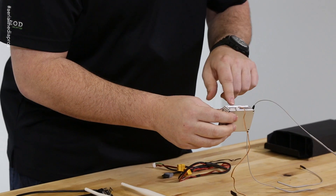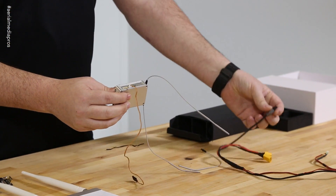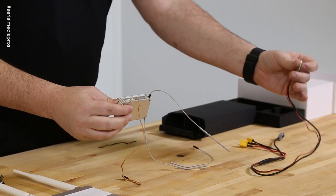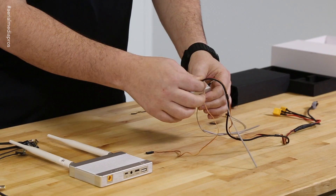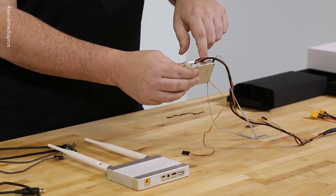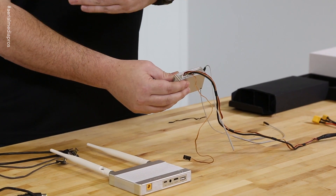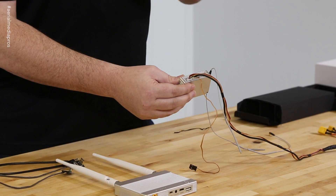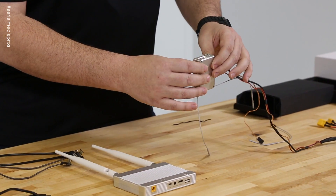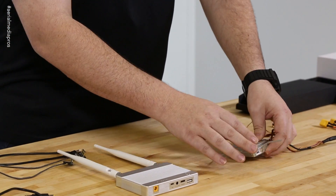While I have this in hand, I'll go over a couple of ports we didn't cover. One is the gimbal port — this is the main plug right here that's going to communicate from your copter to the transceiver. This will plug into like the Zenmuse cam port. You can power it right here with these two plugs, and then the main plug goes right into the transceiver. We also have the USB port. There's a link button right here, so if this lost a bind you can press the link button and re-pair these two together. We have two communication lights: one is the control light letting you know you have a direct control link, and then we have a video light letting you know that the video link is good. On the back side we have two ports: one is the HDMI port for signal coming in from your camera, and one is an SD port for SD signal.